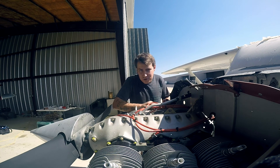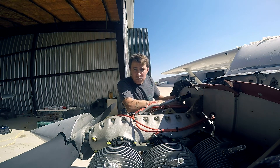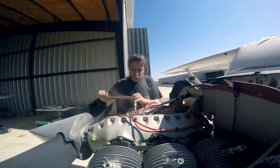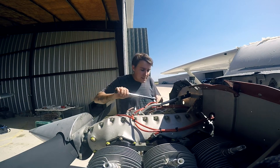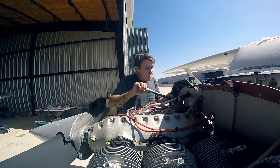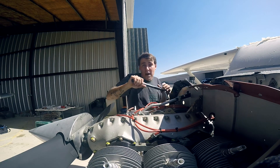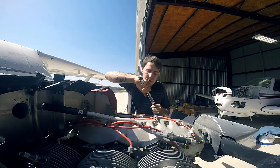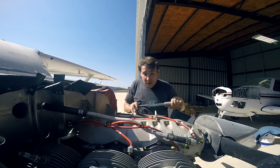So where do people start to disagree? The first flight. Most people understand not to do an engine run-up — though you can check the mags by quickly flipping one off and then the other while taxiing. Takeoff is really where the first disagreement comes in: some people believe you should take off at as low a power setting as possible, while others believe you should take off at full power and not baby the engine.